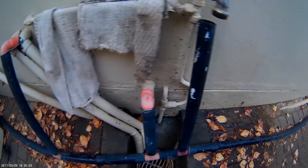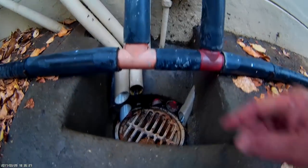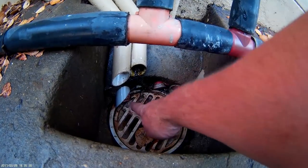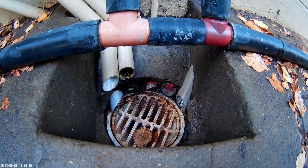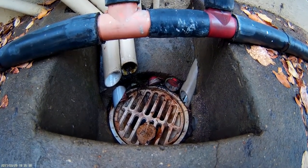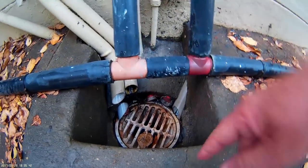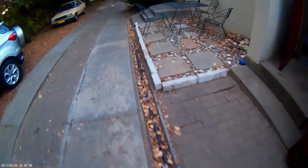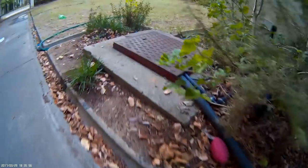So what I do is, at the end of winter, I would put in a few stoppers into all the appropriate pipes, and at the beginning of winter I would just simply knock them out, and the water will just run straight down to the drain. So these then all go in this pipe, and it's all the way into the drain.